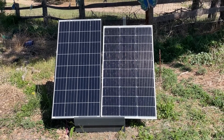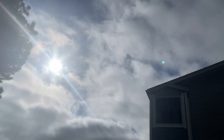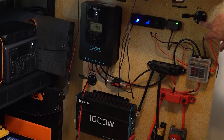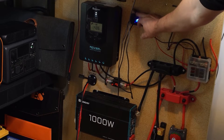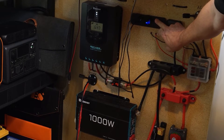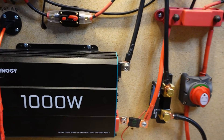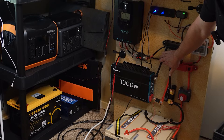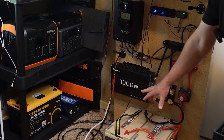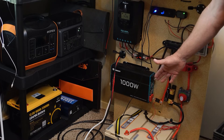Pretty soon I'll have three, maybe even four solar panels. Today it's a bit overcast so I'm getting between five and seven amps. The setup has the ability to charge with solar, plus an AC port, a DC side with USB chargers and a cigarette lighter port, and an on/off switch. The reason I only have a 1000 watt inverter on here is that the wiring is sized for that, and I don't want to pull more than 1000 watts because it would drain these batteries too quickly. If I pulled 2000 watts that's basically only two hours of runtime on these batteries.